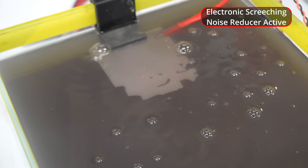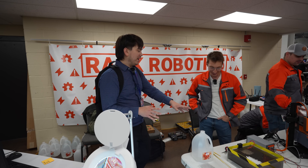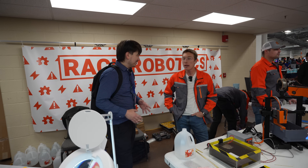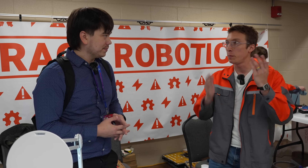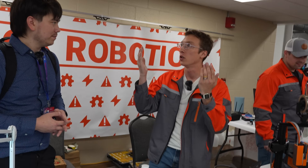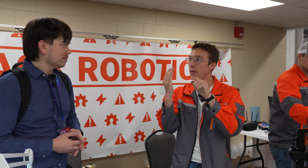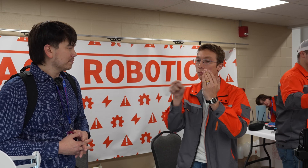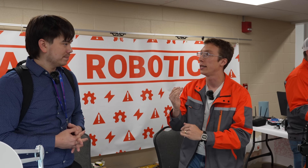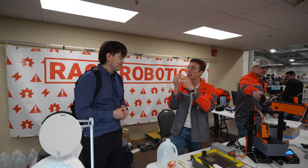The first time we put this together, I was sitting there for like an hour and a half just playing with it like that. Like, wow, it actually is a thing. Let's take a few steps back and talk about the process. Is it melting the metal? It's vaporizing the metal. EDM functions by taking two pieces of metal — you've got the tool and you've got the workpiece — and you apply an electrical potential across those. So positive on the workpiece, generally negative on the tool. And when you get them close to one another, there's a dielectric breakdown between the two pieces in the water. A lightning bolt jumps across there, and that lightning bolt vaporizes part of the tool and part of the work. Then you shut off that lightning bolt, turn it back on, and you do that 5,000 to 20,000 times a second, taking little chunks out of the work.